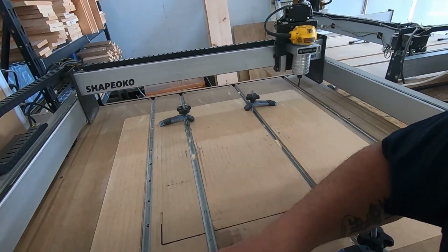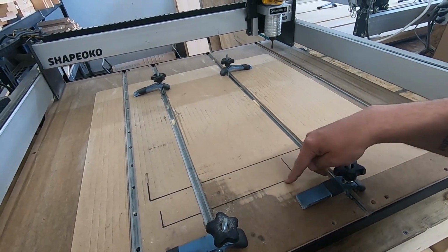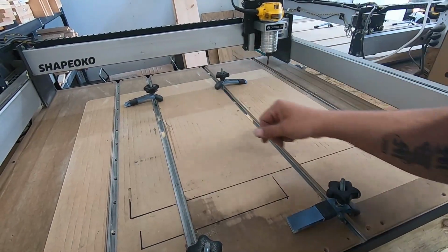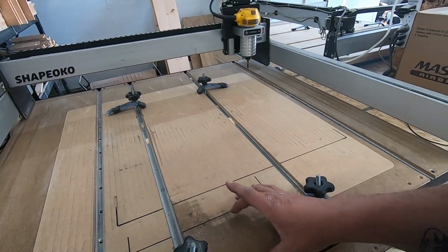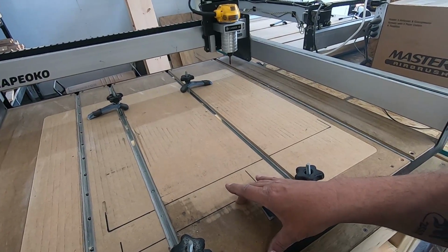And then you notice you have these marks here. These marks here are for the standard boards that I do. I do the 12 by 24 horizontal as well as vertical. And then I set it in there, and then I measure it out to make sure that the distance is right on the bottom and it's square before I carve the job. Because I don't want to have a carving unit that kind of goes off to the side. And has that happened? Yes, it has. Thankfully, like I said, you learn your lessons along the way. You do, your little mistakes and everything along the way.